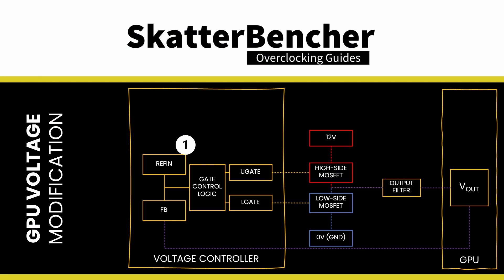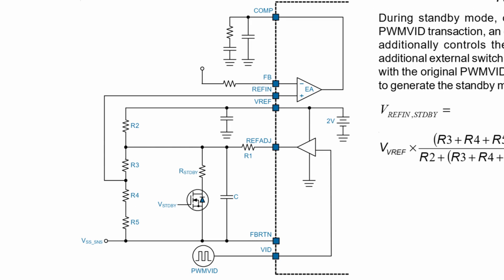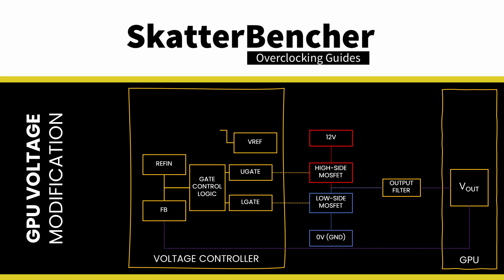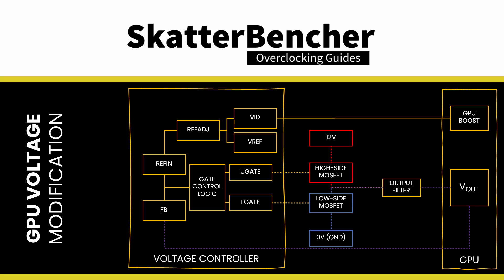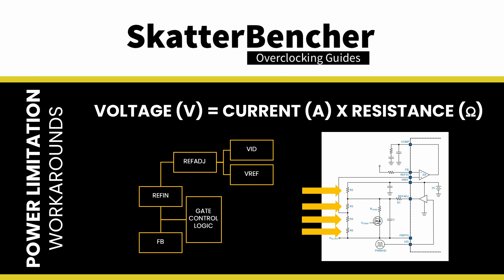So that leaves us with the REF-IN voltage to control the voltage output. Under the functional description, we find a more detailed overview of the voltage control loop. V-REF, REF-Adjust, and V-ID control REF-IN. In short, a boot voltage is set from the 2V reference voltage. This voltage can dynamically be adjusted by a REF-Adjust output, which is determined in this case by the V-ID. The V-ID is, of course, controlled by our GPU and its GPUBoost algorithm. To manually adjust the reference input voltage, let's check Ohm's law: voltage equals current times resistance. We can replace any of the four resistors — reducing the resistance of R2 or R3 would increase the REF-IN, whereas lowering the resistance of R4 or R5 would decrease the REF-IN.